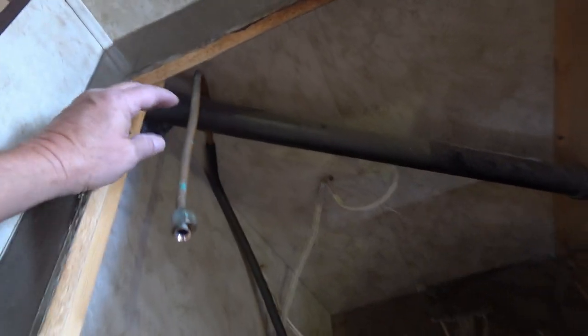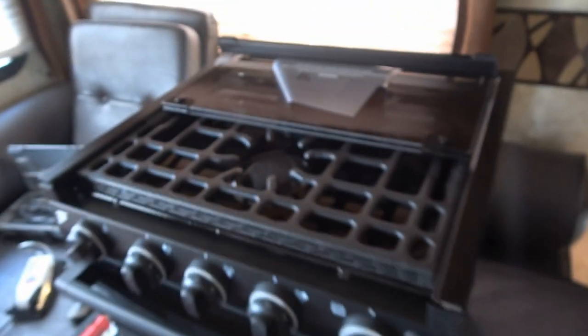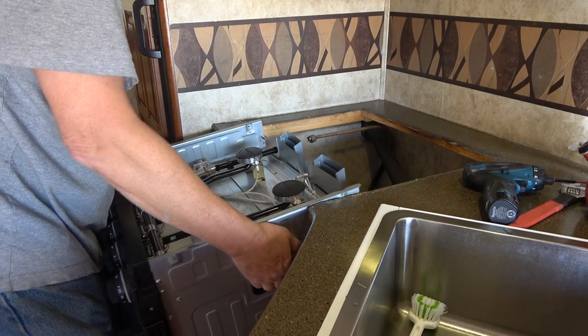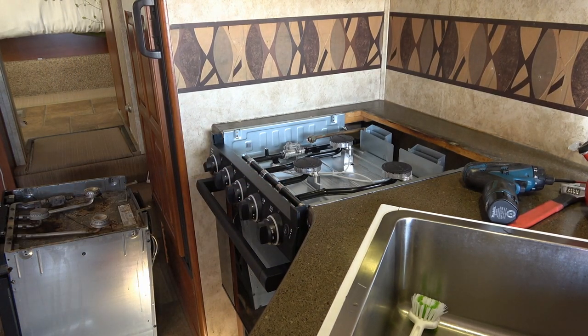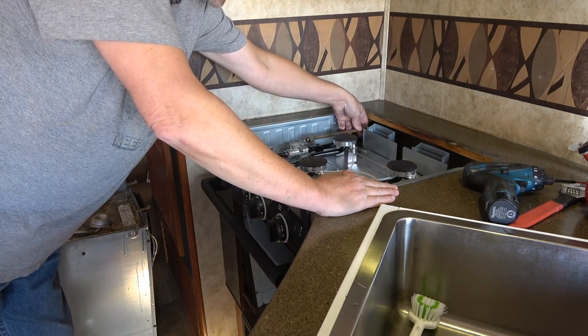Let me show you why I'm going to have to actually cut this copper gas line and move it back. You can see they have a flared connection here — that's what I needed the flaring tool for. The new unit's gas hookup is right at the back, a little bit shorter. Next job is to see if this thing's going to fit in that opening — and yes, it goes right in there. I'm going to have to just adjust that gas line back there.